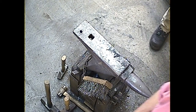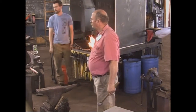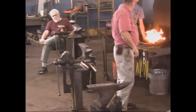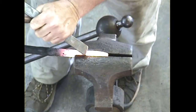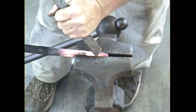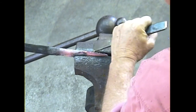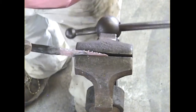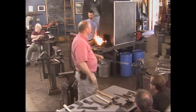So we're going to go to the next method — we'll put the burrs just on the edge. All I'm going to do is put the chisel in at an angle, and that's just going to roll a burr, a little sawtooth right off the edge. Then I'm going to come back and do the same thing from the other side and hopefully get opposing teeth. I end up with just what I passed around there — teeth pointing both directions that are going to dig into my main axe body.